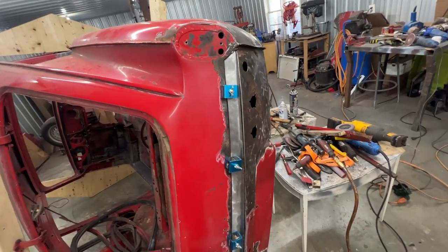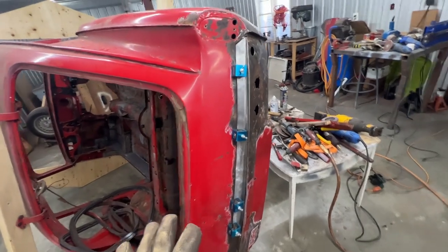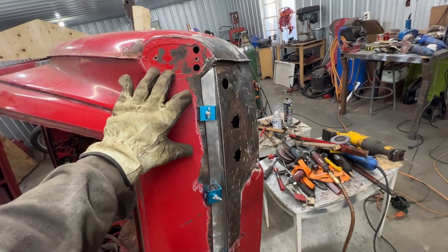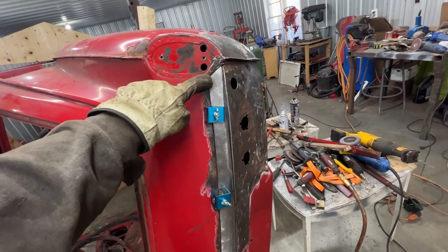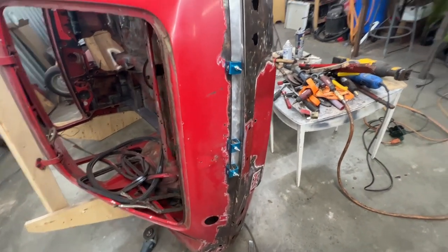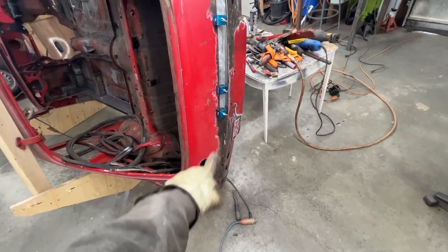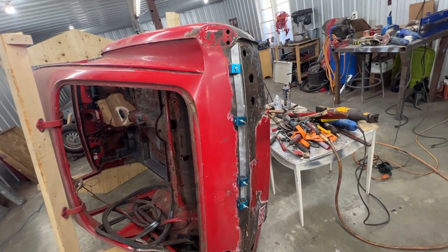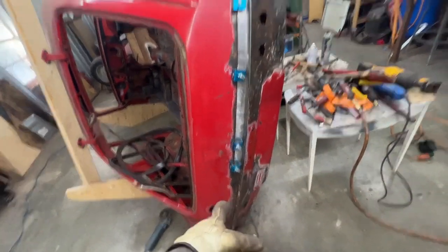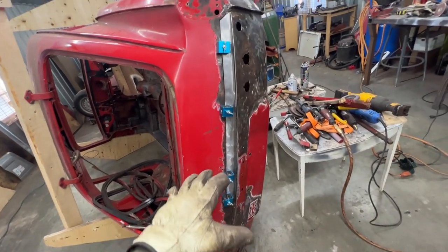Well, it's really slow. So what I'm gonna do, if you haven't seen that video, what my technique is, I do only one tack at a time anywhere. I'm not gonna do more than one tack at a time. Just one here, one here, one here, one here, one here, and then stop and wait. And of course, in the meantime, I can start doing the other patch for there. And now it's cold in the garage anyway, so it's gonna be cooling down pretty fast. So 3-4 minutes work on that, and then come and do another series of one tack individual here and there,